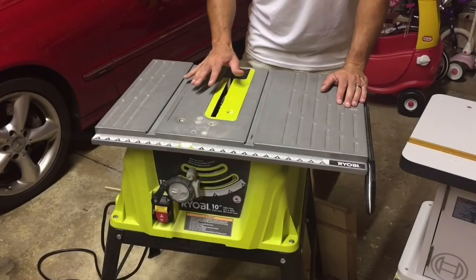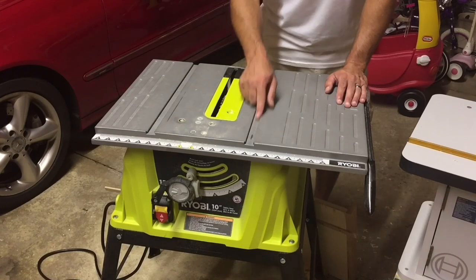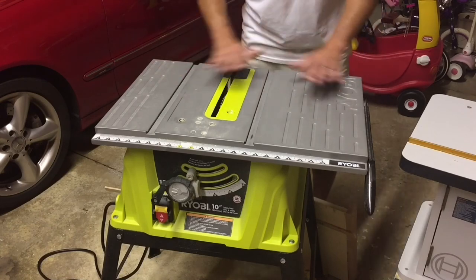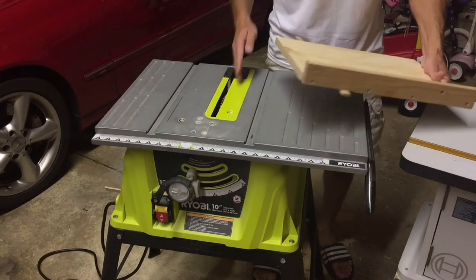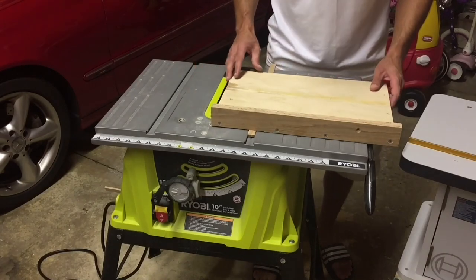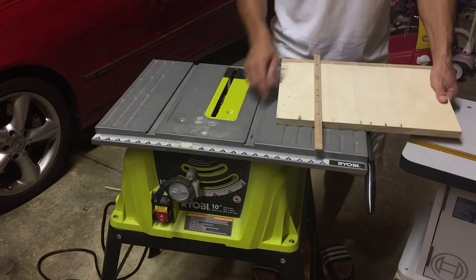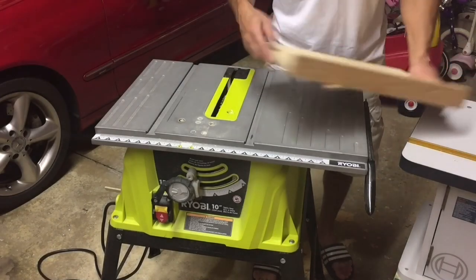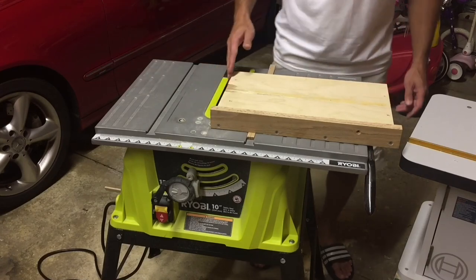I don't have a really nice table saw, but I was able to at least make cross-cuts with it. The table saw has a steel top; the miter guide is not the standard ¾ inch — it's not cast iron, it's not flat, it's not perfect. But I was able to make some sleds to do my cross-cuts, which is important because you need a perfect 90-degree angle. To make my sleds, I planed a piece of red oak down to thickness so it would fit in the slot, and put slide strips on the bottom so it slides nice and smooth. I have one sled for the dado and another just for running the blade.